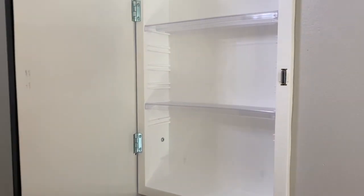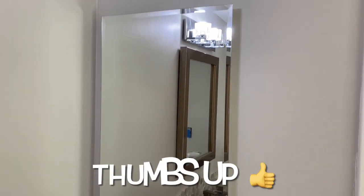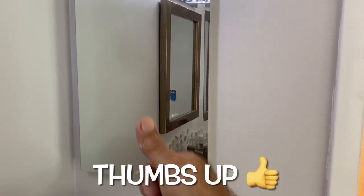All I'm doing is adding some blocks of wood in here to be able to attach it. It's going to be sitting on top of the drywall, so it's not going to move anywhere. I just used these screws with a nice big head and screwed into the blocks of wood that I put inside the wall. It's that simple — you can do this too. It looks really good and the customer is going to be happy.